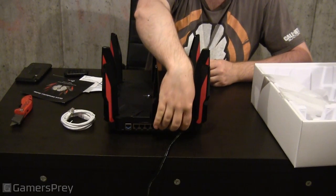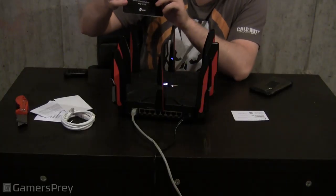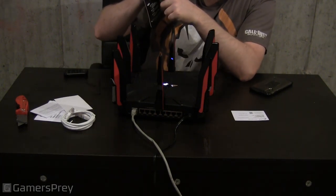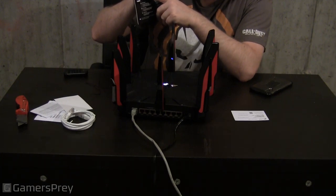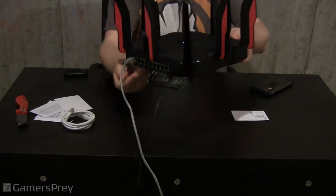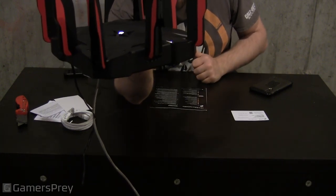Go hit the power button — you can see a nice shiny white line on it. For the lights: pulsing orange means the system is starting up, solid white means the router is working normally, solid red means no internet connection, solid orange means the router is connected to the internet but Wi-Fi is off, pulsing white means the firmware is being upgraded or WPS connection is being established. For the buttons on the front: you've got a WPS button, a Wi-Fi button to turn Wi-Fi on and off, and an LED button to turn the light on and off — handy if the router is in a bedroom.